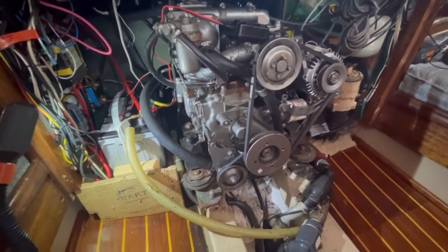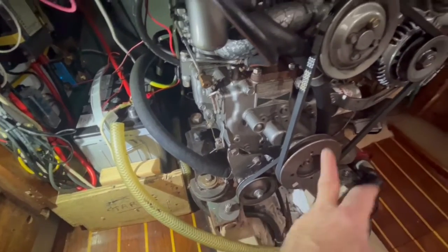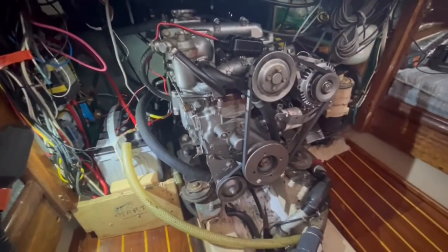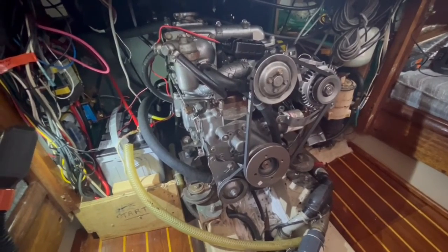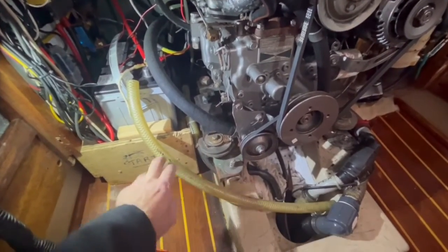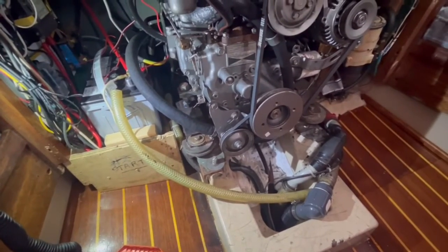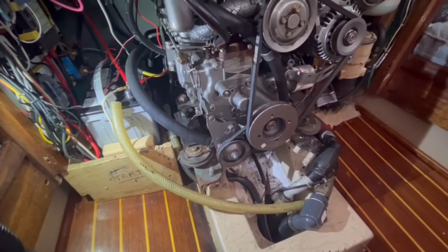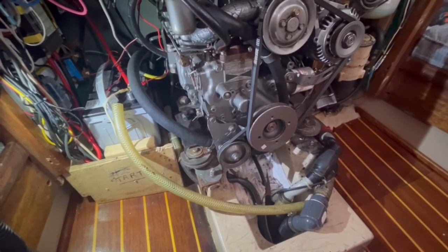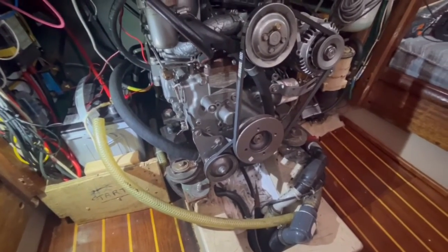It's getting cold in the Pacific Northwest so it's time to winterize the diesel. This is the seawater intake that comes into the seawater pump, goes up to the water pump, circulates through the heat exchanger, and then goes through the water muffler and outside. What I normally do is take this hose off, attach a little extra hose, and put it into a bucket of RV antifreeze — which is environmentally safe. As soon as I see antifreeze coming out the muffler I shut it off and stop running the diesel for the rest of the season. That's it — thanks for watching, give me a like if you enjoyed, subscribe, and I'll see you next week.